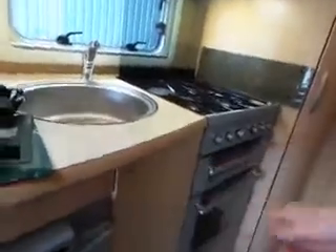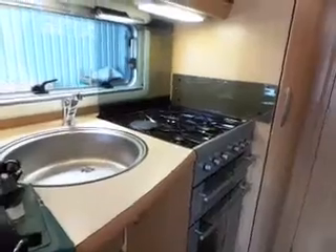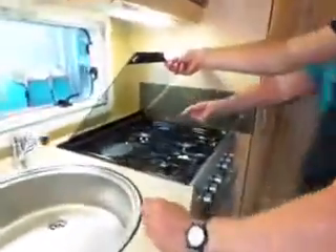Inside here you've got individual gas appliance taps, colour-coded, on the left-hand wall. The info notes on your door explain which angle they need to be at when on and off. You don't need to turn them on or off normally — your main one is the tap on top of your cylinder. If the cooker isn't lighting, just check those taps in case the gas engineer forgot to turn them back on.